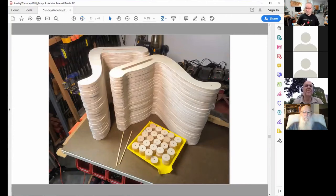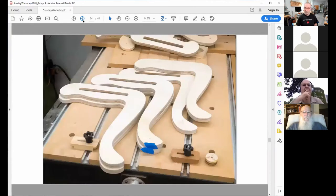Down in the tray below are little spacers made out of closet rod that separate the legs and keep everything stiff at the bottom. The article gets into a lot of details about pulling off the bench. One of the things you'll need to do is make a couple of special parts — end parts. There's one that does not have the slot go all the way through, it only goes partially through. You're also going to need two parts that don't have screws through the bottom or top edges because they'll show. Those are the parts you make first before you start screwing things down.